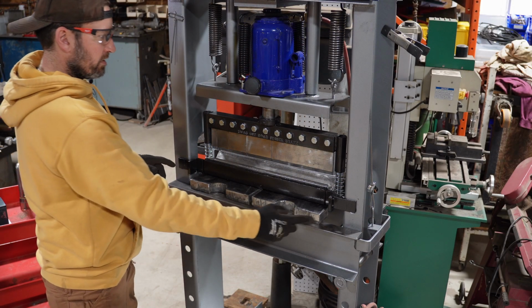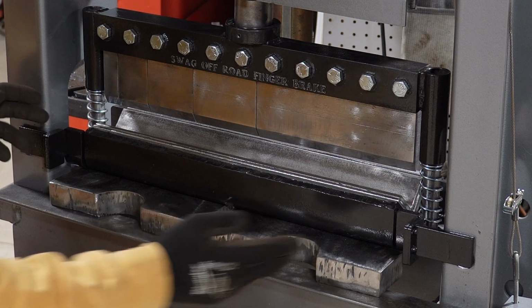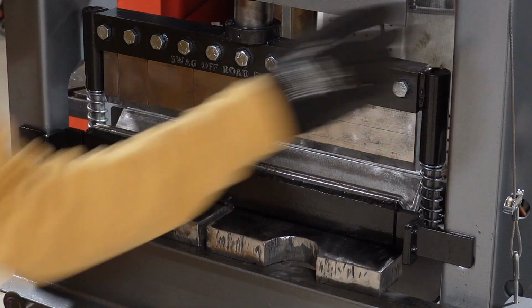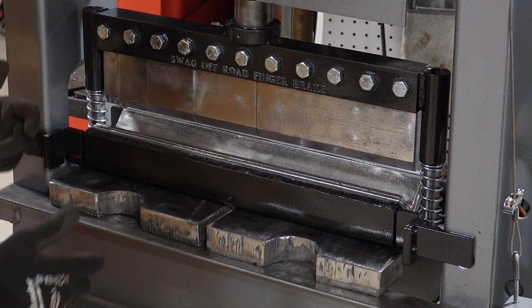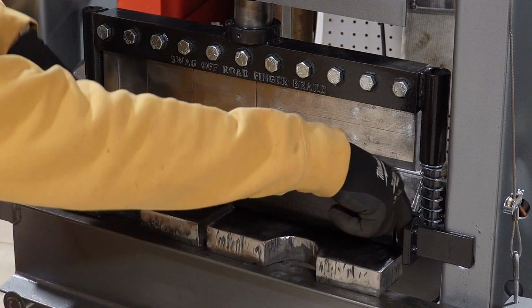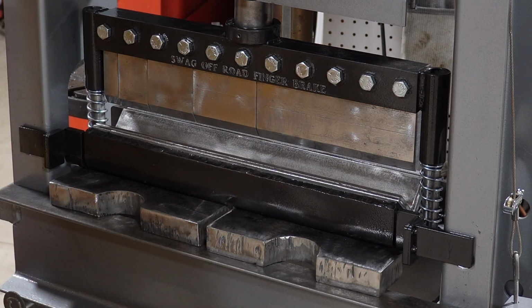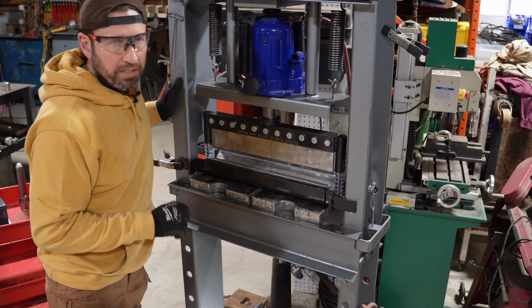The other thing is they give you these tabs, the ones that I have perpendicular that are sticking out. Those are meant to go where these ones are. But like I said, my rails are almost twice the thickness as the Harbor Freight 20 ton. So I put them in so that they point out, and then added in some 1/4 inch plate there, which once I get it in, I can just clamp it in place, even though it's not really that necessary.